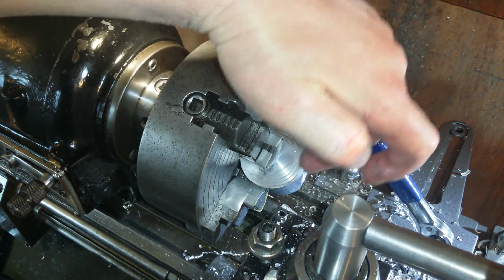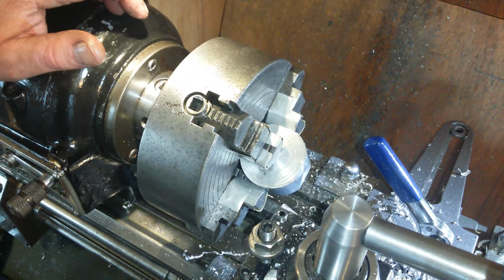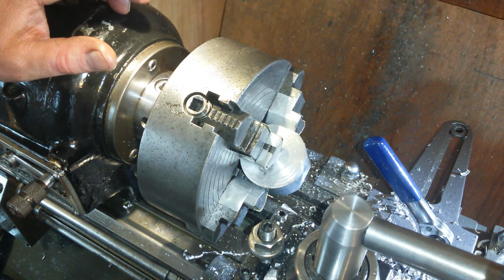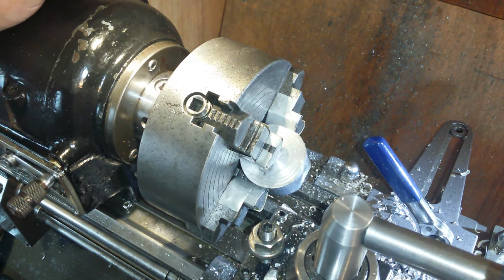So I've got a lovely flat surface there, really nice. One big problem with this surface that I've just done, I didn't drill it. I need to drill into approximately halfway with clearance for an 8mm bolt, so 8.5mm. I didn't do it. So I'm a bit annoyed now. I'm just getting ahead of myself, but I'm managing to stay calm. And staying calm is something that you need to do when you're at the lathe. It's a very dangerous piece of equipment.